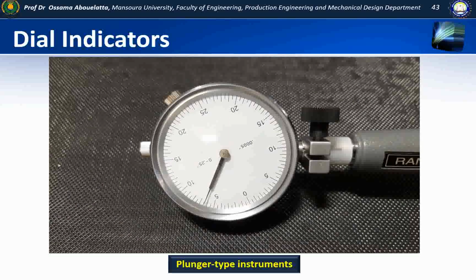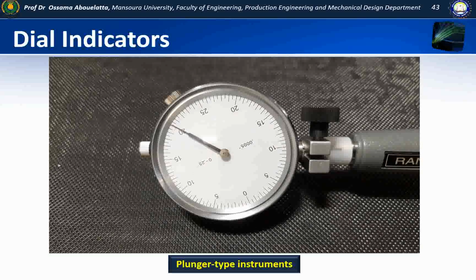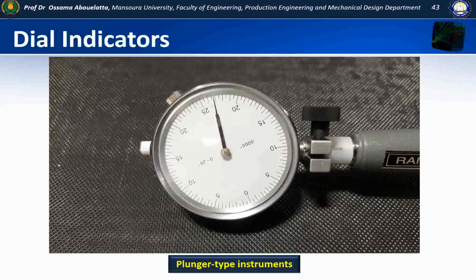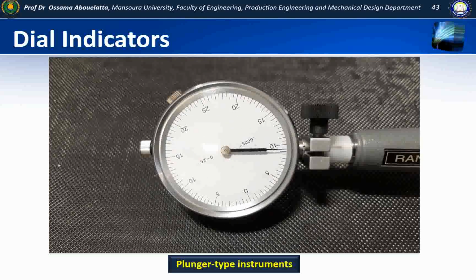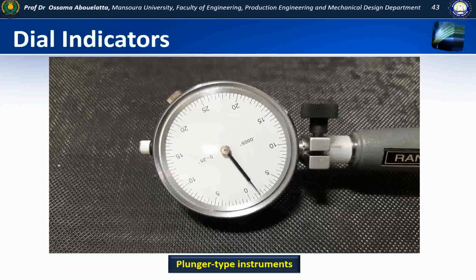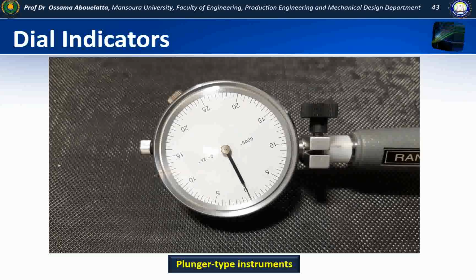I wanted to zoom in on the gauge here, just so you can see exactly what I'm doing with the micrometer. I'm just slowly tightening it until the indicator on the bore gauge comes around to zero. At this point, I'm going to lock the micrometer, remove it, and read it to get my maximum bore diameter.